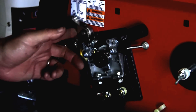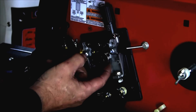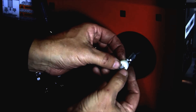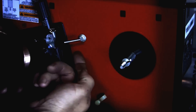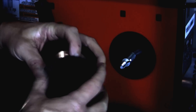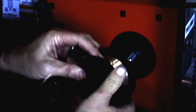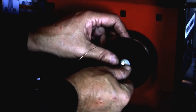We're going to install wire into the machine now. This is the pivot arm assembly, this is the tension arm, and this is the drive roller. I'm going to install a roll of wire, so I'm taking this wing nut off — this is our brake, it's got a locating guide slot. The roll needs to feed over the top and into the incoming guide, not underneath. These rolls are under tension, so when you open the package it's going to unwind unless you keep tension on it with your thumb or a piece of tape. Insert it, locate the brake on the guide, and put the wing nut back on.